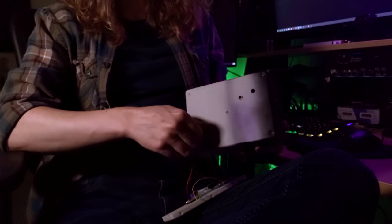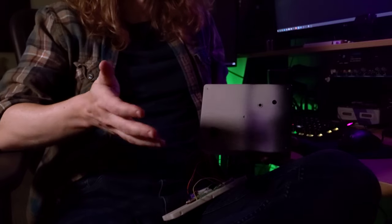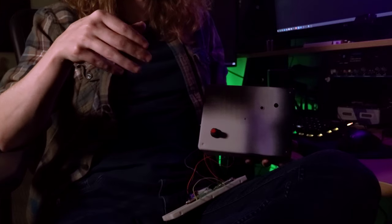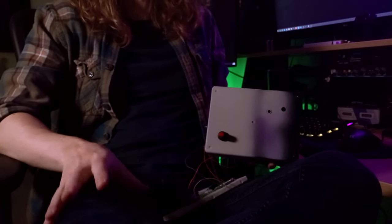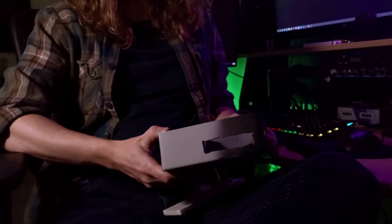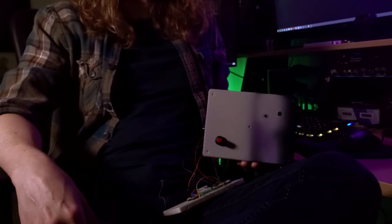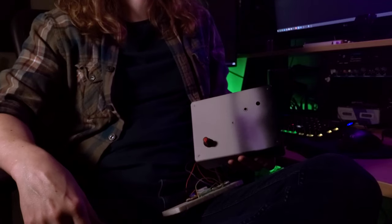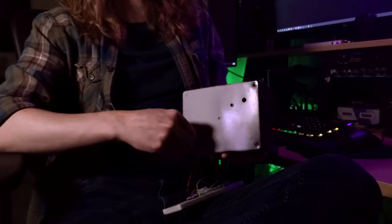That's pretty much it — it does work. A couple of things if you decide to build this yourself: be really careful when you take apart and reassemble your potentiometers, because I messed a couple up where the wiper — the part touching the resistive element — was occasionally losing contact and screwing up readings. It was good to spend more time on the mechanical side, which is somewhat of a weak spot for me. If you come up with any improvements on the design, let me know. Like and subscribe, and see you next time when maybe I'll put this design to use in a real circuit.